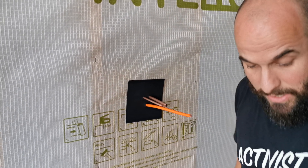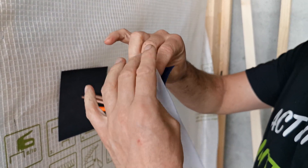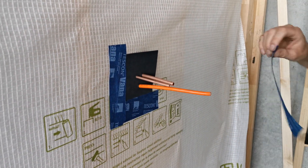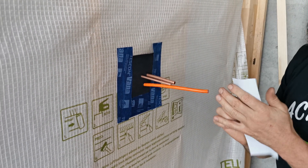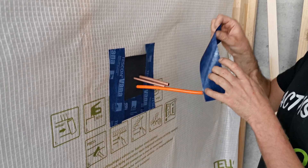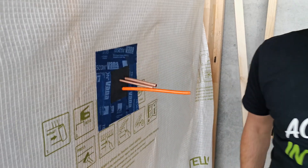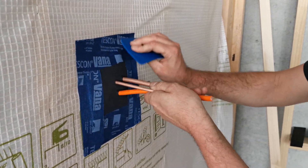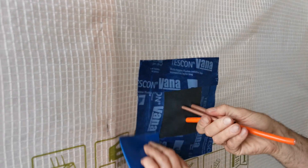Now it's really important as well — tape your grommet properly. Use a tape. It's really important to tape without any tension on the tape. If you stress the tape, it's really difficult for the adhesion to adhere over a long time. And always use a press fix to really activate the glue of the tape. That's really, really important.